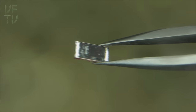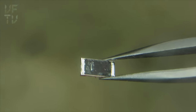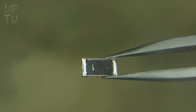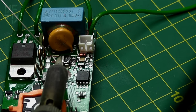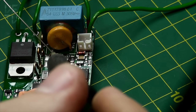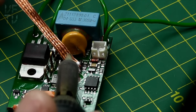Looking at one of those removed resistors up close - you can see they're in a really poor state. It actually looks like they flashed over, possibly due to moisture or dust where the conformal coating hadn't done its job properly. Definitely needed to be removed. I'm going to clean up those pads - first put a little bit of fresh solder on them to help wick the old solder off, then use desoldering braid to leave behind a nice clean pad.